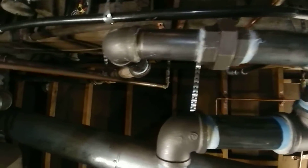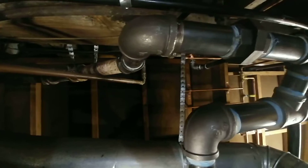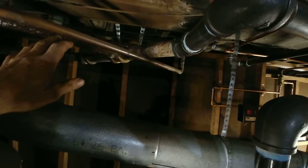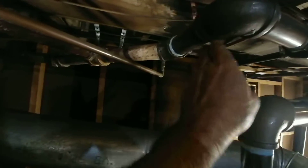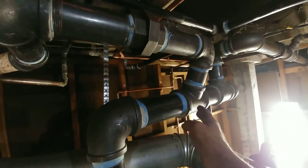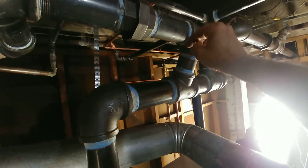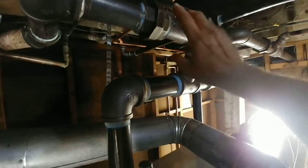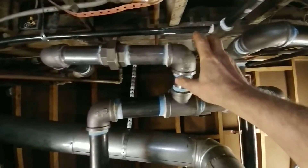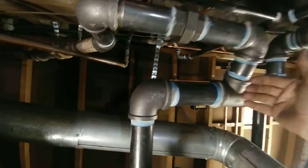Part of this section is parallel flow, but this section here was originally tied in with a bullhead T and hammered like mad — that's counter flow. We have a couple of radiators coming in on this T, and the condensate is continually draining back against the steam flow here. So we tilted this to the side a little bit so the condensate could drain in without interfering with the steam rising up. This is a fairly short main at this end, so we can allow condensate and steam to pass each other in an efficient and quiet manner.